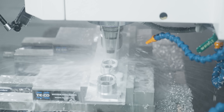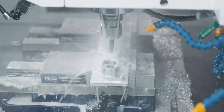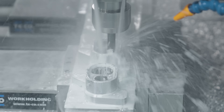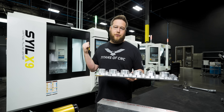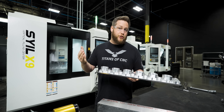After it spirals down to the bottom, I'll come back and do a small roughing pass towards the bottom of the part, because I need to relieve that stock back a little further so the ball nose tool can come in and finish all the way to the bottom. You'll have whatever your ball radius is sticking out below, so after this we'll rough out a little bit below that finished surface.